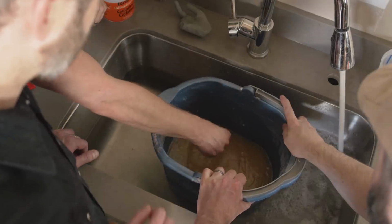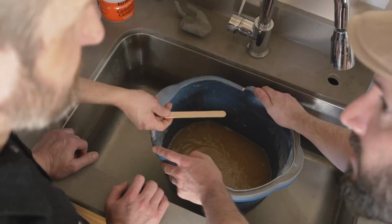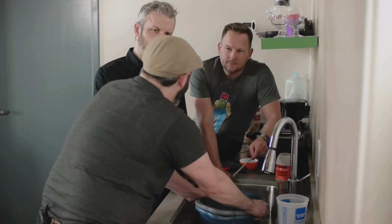It's very applesaucey. At what point do we know we're ready? It will turn back into a liquid. It will be completely liquid. And then we're gonna pour it back into the mold. When I did it, I had a metal pan. That transfers heat really, really a lot faster. I did first try it in a Pyrex thing, and that didn't work? Not at all. Insulating things are not so good. It's a plastic bucket. Conducting is what we want.